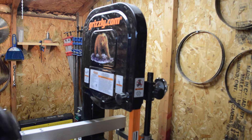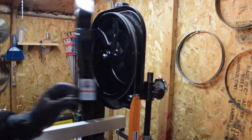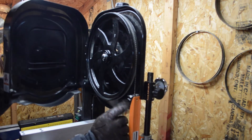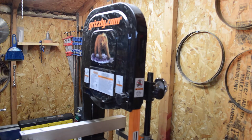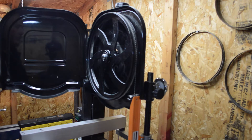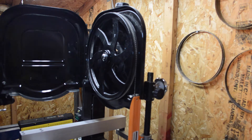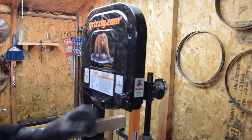The first thing I noticed when I put it all together was how these knobs are actually just pull-release — you don't have to twist them, they're basically just locked in. There's a little tab right here on the door and right here that kind of just click together, so you just push it tight. It's a little loose, but all it is is just a guard covering the wheel. Really quick and easy — very quick to change the blade, and sometimes when you're making a project you have to change the blade a lot, especially if you're doing bandsaw boxes.